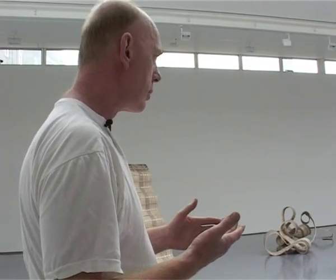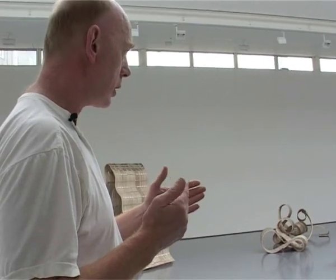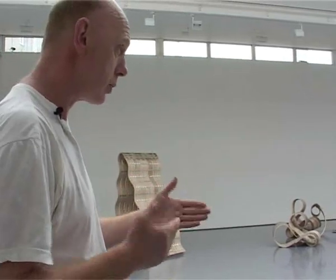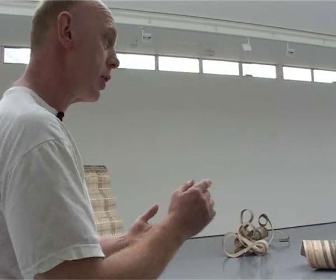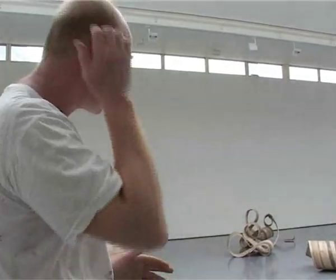So the pieces are made individually. Once they're bent, the bend needs to be held for a couple of days in order for the wood to dry off, and then it becomes quite stable. In previous things I've made, it's been very important to maintain dimensions, so I've used very elaborate drying jigs. In this case, it hasn't been so important, because another thing the tabs do is they line up individual pieces against one another, so that it ensures that across a particular surface there is a continuity.